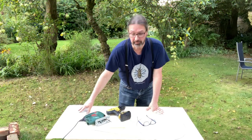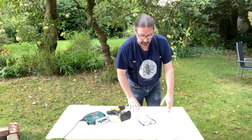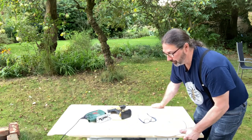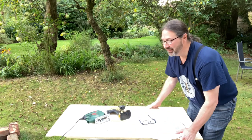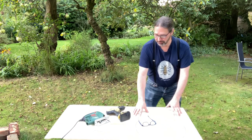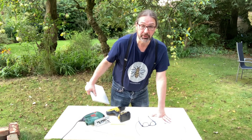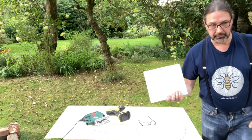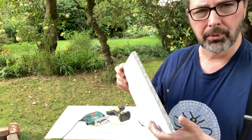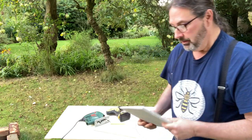So you can use just about anything you want for backing for a mosaic. In this case I'm going to use this 3/4 inch plywood, or 18 millimeter or whatever it is. It's this thickness here. I call it 3/4, even though it's not actually 3/4 inch. This table's for interior use, but you can get this product called, the brand name is Hardie Board, I think, or Hardie Backer. And it's basically cement. So you can use that as well. It's a bit harder to work with,